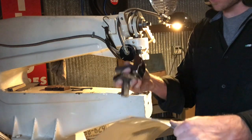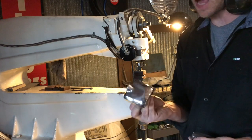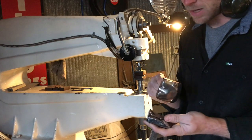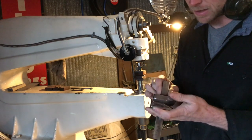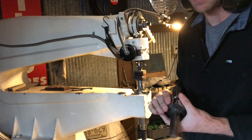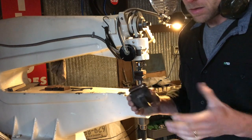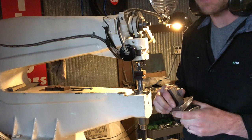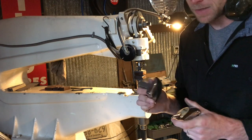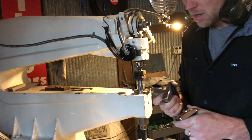Now, before I start, I'm going to explain how shrinking actually works. This is what the bottom die looks like. This is a steel die. Just for the sake of showing you, I'm using it. These are not steel. They are a hardened plastic. I rarely use steel on my aluminum because it just beats the tar out of it and scuffs it up, and it leaves a lot more finishing work to be done. The plastic materials leave a very, very small amount of any damage to the aluminum, and it's nice. They also shape fast too, really. You'll see the speed at which they can get this stuff formed.